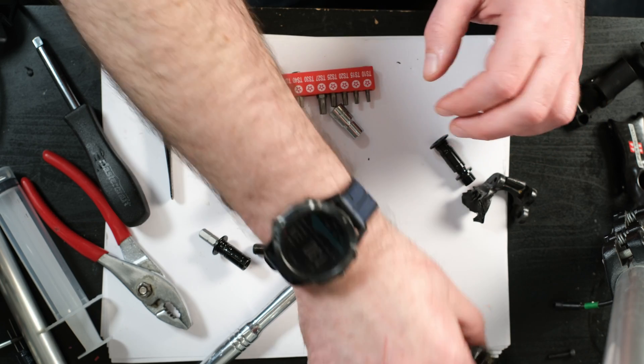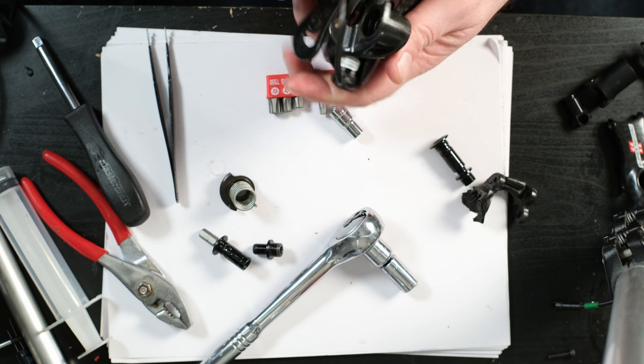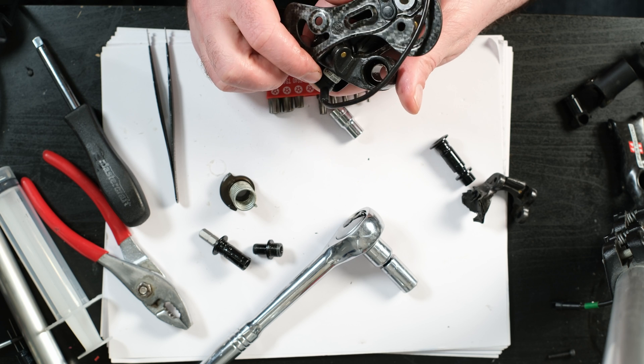So tight that the security driver was now embedded firmly into the soft aluminum. I dealt with it later, but it kind of cost me the quality of those threads on that screw-in bit — not great. But it did inform me that there are two rings, which I'm pretty sure are aluminum, possibly stainless. They don't want to come out easily; they're either bonded or heat-staked in there into the glass fiber-filled nylon. Now I've realized there are a bunch of pieces I'm missing, and either I need to redesign them and get them machined, or steal them from another derailleur — a good derailleur that could be the donor.